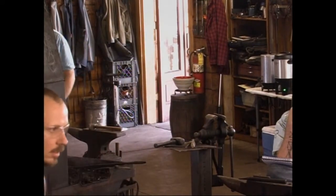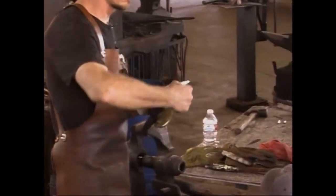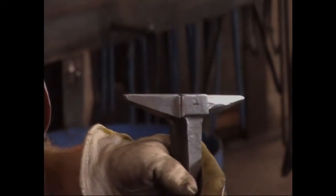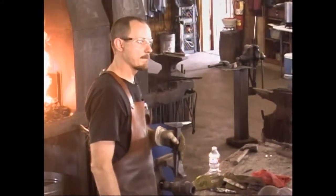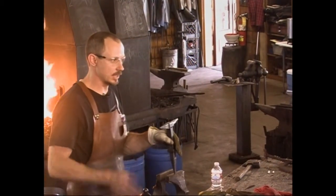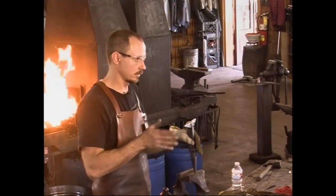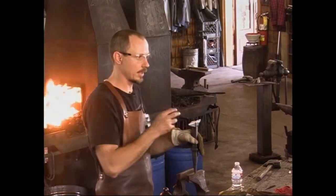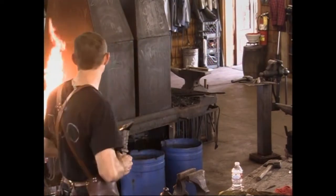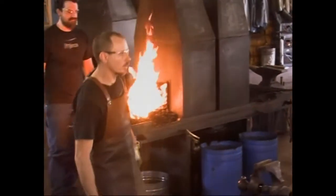So the one that cracked, did it crack like right along the top? It cracked across the face, all the way across the face, and then down the length of the Bick, all the way to the end. Was it used rail? No, I don't believe it was, because it was a slice along the rail and it had no deformation. I believe it was brand new rail, cut, and then fitted, and that the slice had never been rolled on, is my belief. Anyways, it's risky, so now I am oil quenching them.